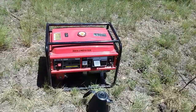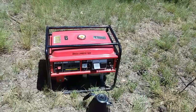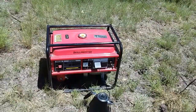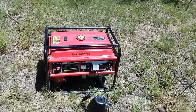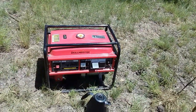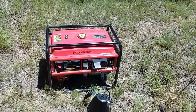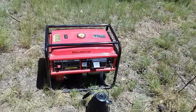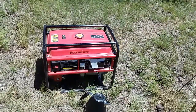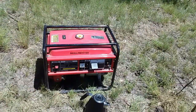Voltage is generated and current is supported. Okay, you can hear when the generator slows down, there is an opposition of magnetic fields. You can hear it in the form of torque on the shaft, which slows the generator down and puts it under load. Very, very simple stuff. Nothing hard to it. The generator is a symmetrical device, and therefore, because it's symmetrical, the force that you put in is the force that you get out, minus losses.